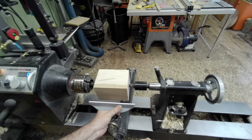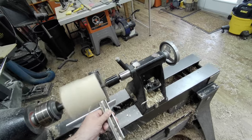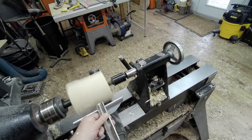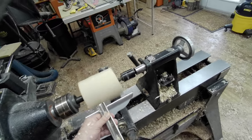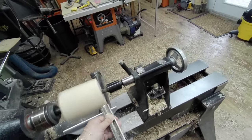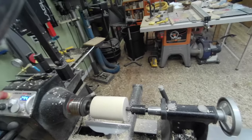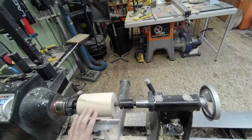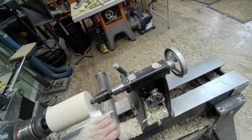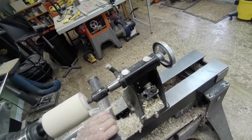Is this thing big enough? I use a spindle roughing gouge to bring this to round, and then I had to make a tenon, which I use a skew chisel for on a peeling cut. There's a bit of sound there because I was too lazy to sharpen my skew chisel. So if you hear any vibration sound, that's what that is.